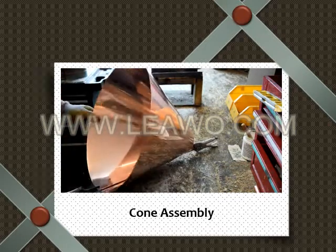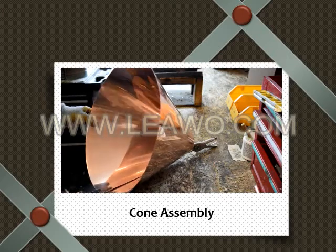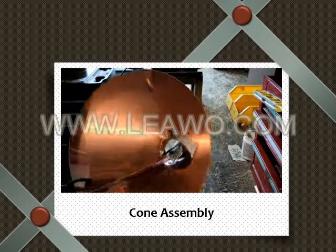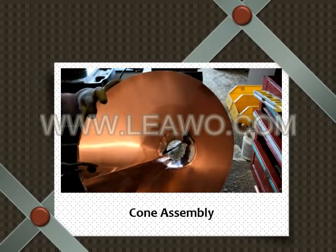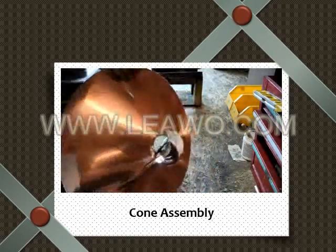So the reason why we clamp more is because we wouldn't want to just solder it just like this. We really want to clamp the crap out of it, make it so those gaps are filled. There should be no gaps. If there is a gap, plan on filling it with the solder. Low heat, low temperature.